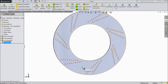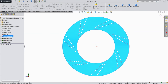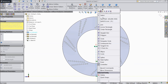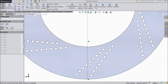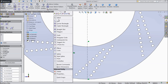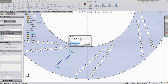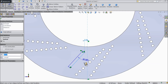Now select this face, sketch normal. Now we will create one geometry here. Exit. Now select 3 point corner rectangle and draw a rectangle like this. Exit. Now assign dimension from here to this point 2.84 mm and the degree,